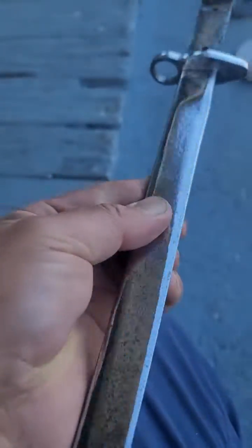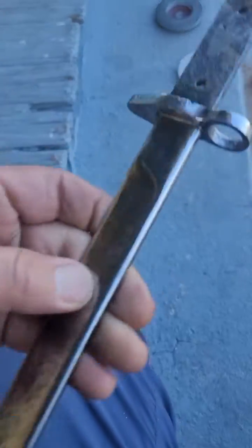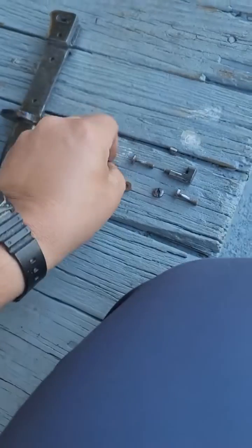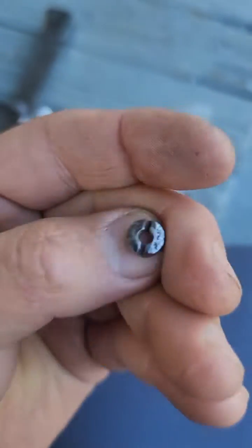After polishing — not scraping, not grinding, just polishing — look at the difference on the blade. It's like night and day. I use my regular grinder but with polishing discs, not grinding discs. I start at 200, then 400, 600, 800 grit. You can grab those pads and scrub the piece to make it look exactly like this.